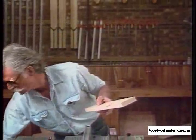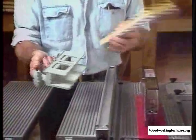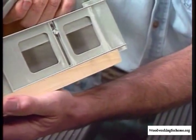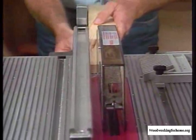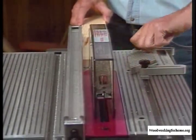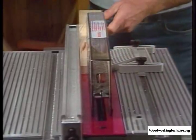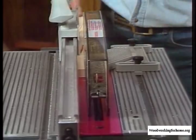Now let's say we want to cut this piece in half — obviously the space between the blade and the fence is going to be too narrow to use the push stick, so how will we do that? The handy dandy fence straddler. This is a device that slips right over the fence and is designed to catch with this little notch here — it'll catch the back of the board as we push it right along through the fence and through the blade. For this cut I will need to readjust the fence, and we'll also need to readjust our feather board — bring that right in close and tighten it up. Now we're ready to go with the fence straddler.